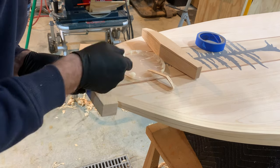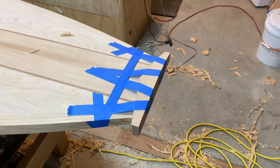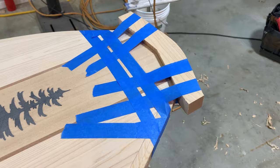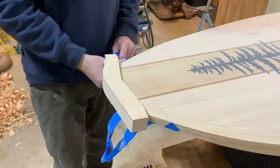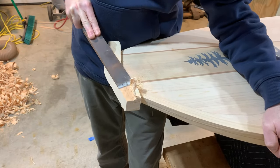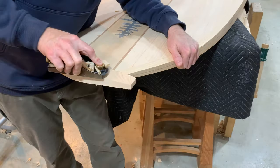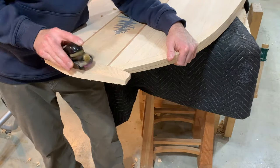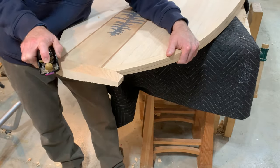It's just so easy. And because it's very thick, you can just tape the piece on there. As long as the fit is tight, you don't need any extra pressure — tape was perfect. After that kicked off, I had to trim it all down. I probably could have made this block a little bit smaller, but the day I glued it on I think I was just pressed for time, so I glued it on big. I first brought that all in plane with the deck.